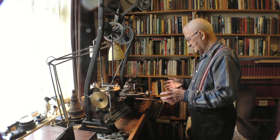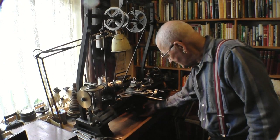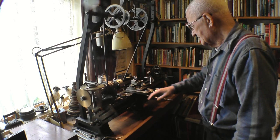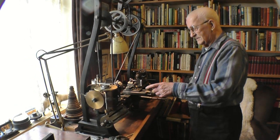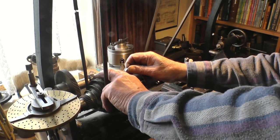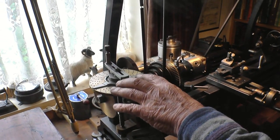The main things to notice about it: one of the characteristics of the Birch lathe is that the saddle is on the front of the lathe, not on the bed. That means you've got an adjustment here that you lock off wherever it needs to be, and there's rise and fall on the cross slide — so there's never any trouble getting centre height, you never need packing pieces under a tool. And it's got divisions on the front of the bull gear that you can use with this little pointer. On the back end, you've got a 180-tooth worm wheel and another tangential gear.